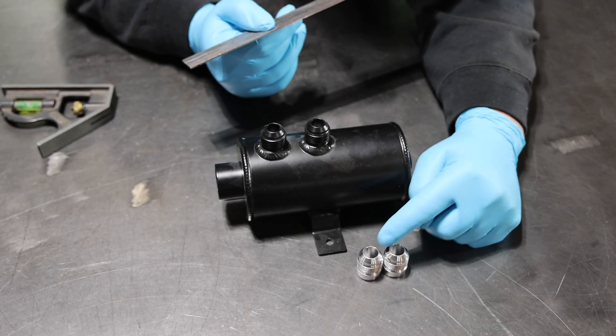We're going to be running our new Typhoon 230 today. We're going to make sure we're on AC. Click in to adjust our amperage — this tank is about 090 thick with the bungs, so I'm going to set my machine to 181 amps. I'm going to turn off my amplitude adjustment, so we're running balanced amplitude on an advanced square wave. We'll adjust our frequency up to 160 Hertz and I'm going to run 35% balance. Everything else looks good, so we're ready to start.